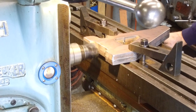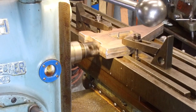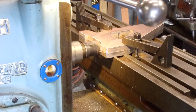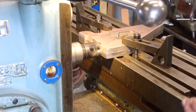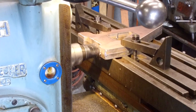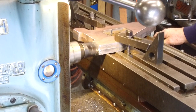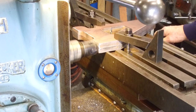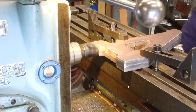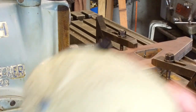Okay, let's come over to this other side here now. Now, if it takes just about the same amount off of this side as it does the other side there, meaning the percentage of flat on there, then we would say that our plasma cut was held pretty close to the squareness, at least by a precision Mitutoyo square off of a nice square Kearney and Trecker table. Pretty darn equal to me.